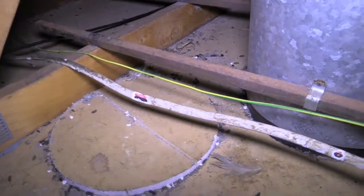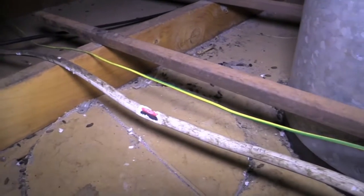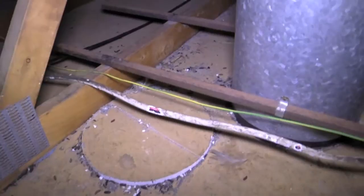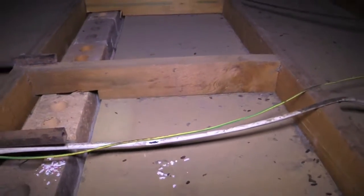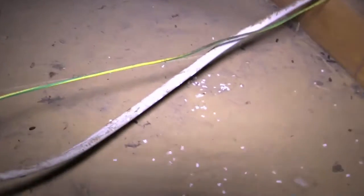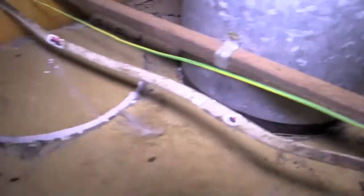You can really see where the rodents have been gnawing through electrical wiring within the roof void. This is always a serious concern as it could cause an electrical fire. It's really important to get an electrical safety switch or earth leakage switch fitted to the electrical switchboard. You can see how the teeth markings from the rodents have gone right through onto the copper cable in some of these areas.